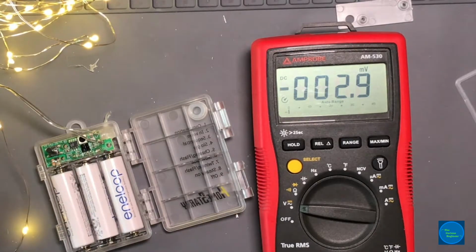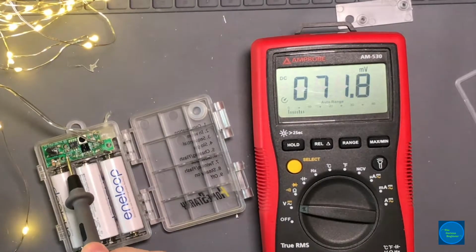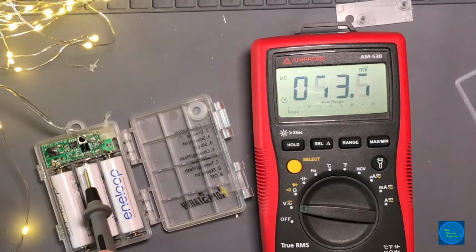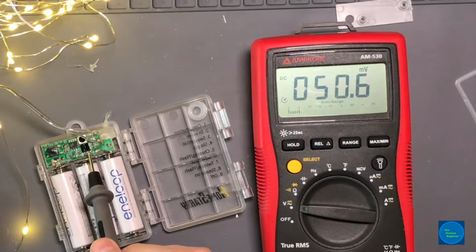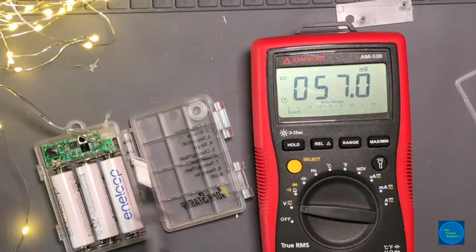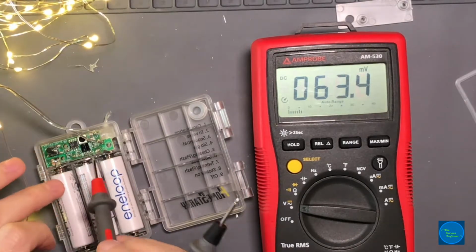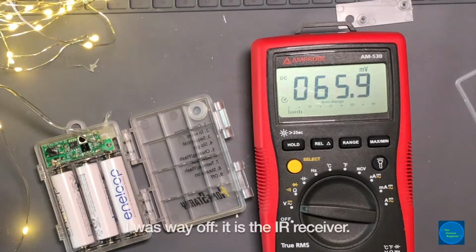But what I'm curious about is what the components are, and can we get 5 volts across this and not blow this thing up? So it looks like what we've got is the little controller, some capacitors popcorned around to provide support and decoupling, the infrared receiver, and this I believe is the MOSFET or a FET, or maybe it's just a BJT transistor, that is just turning on and off the output.